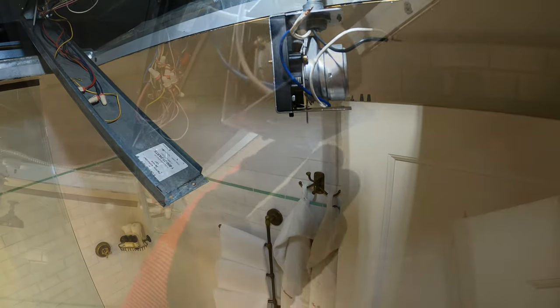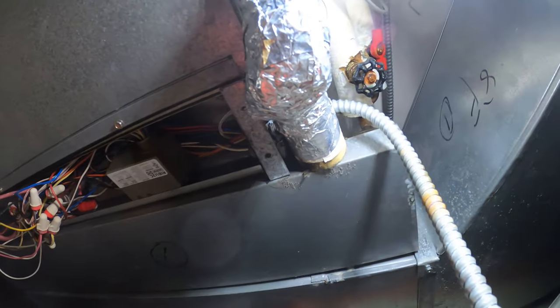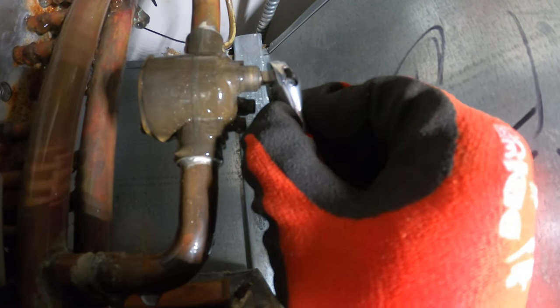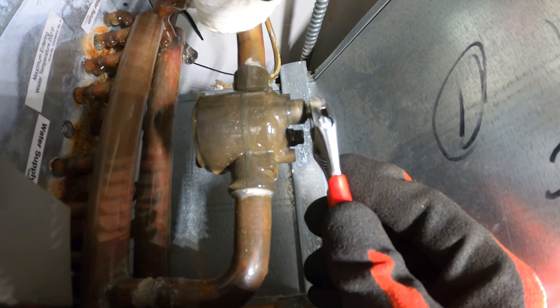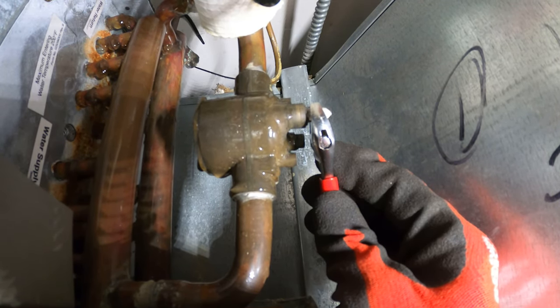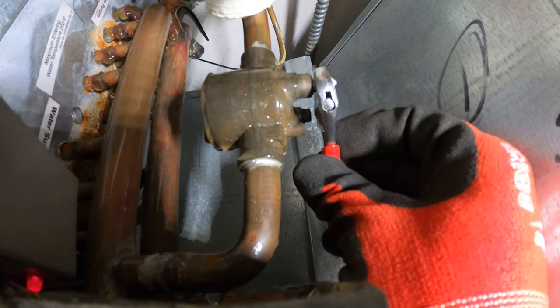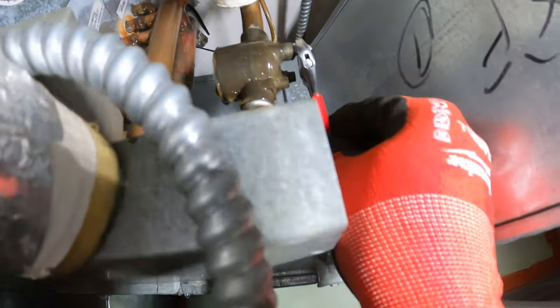It does open but it doesn't spring back. Turn the unit off — this is still free and would allow water if it was on there. I can hear the water running. Here's the valve — by adjusting this little piece you can open and close it. Listen to the sound — you can hear the water. Right there it's quiet, now it's closed. But now it's opening on its own — so something has to hold this closed while I test it. I'm going to close this hand valve. That's going to close our water supply. I can hear the water stopped.